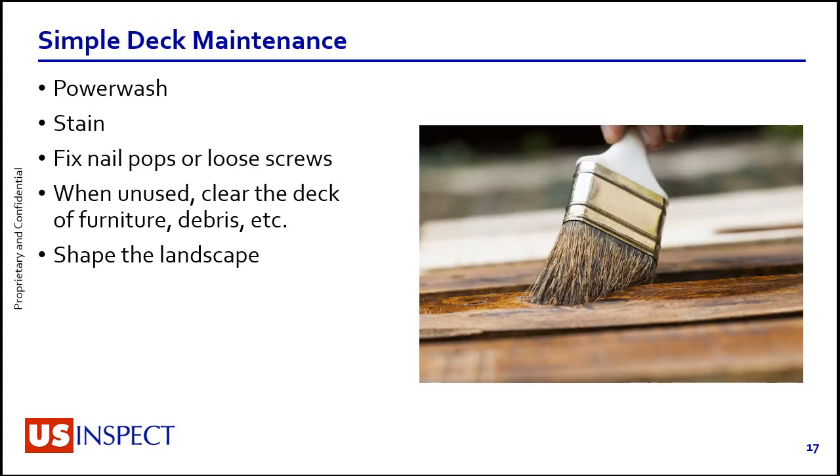On pressure washing: keep that nozzle off the surface. The growth rings we were taught as children to count for a tree's age — the darker stripe is the winter growth ring, a thinner stripe of thicker, denser wood. The wider, lighter-colored stripe is spring and summer growth. If you get too close with the pressure washer, you cut away the soft material and leave the dark ridges — that's why driftwood has that ribbed appearance. You don't want that on your deck. Landscaping outside plays a vital role too — don't direct water under the deck or cause erosion issues.